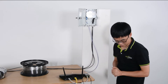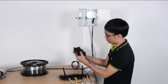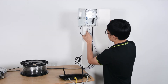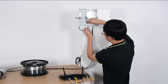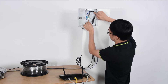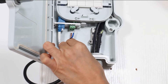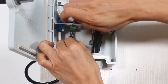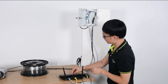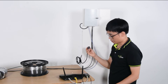I'm going to take one of the fiber optic cables and connect it to the adapter. The data is ready. We also need the power. We are using low voltage DC 55 volts. I'm going to connect the power cable. I will put the power cable into the green adapter, so the power will go through this power cable to the edge. It is important to match the positive and negative, otherwise it may damage your IP device at the edge. So I'm going to use the brown wire to match the red and the blue to match the black.